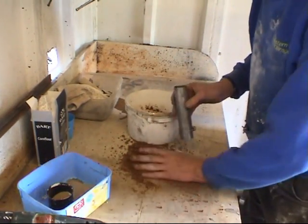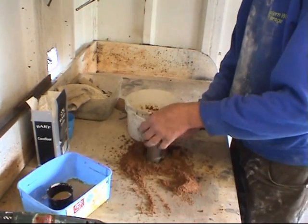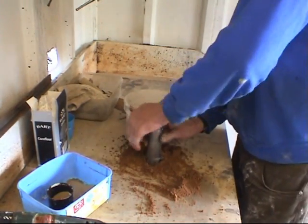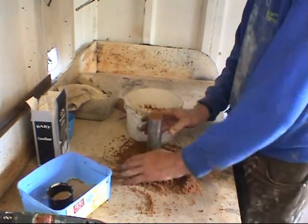As you can see here, the sand is nice and crumbly and light, not sticky and horrible. You don't need a great lot of force — it's filled from each end and gently pushed down with a finger. If you compress it too tight, the core will be too hard and it won't collapse when the metal is cast.